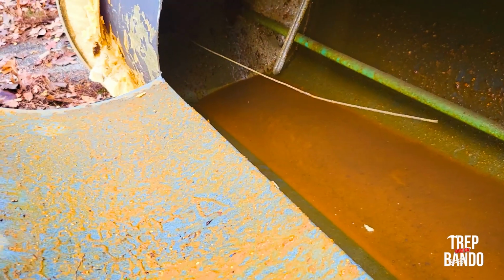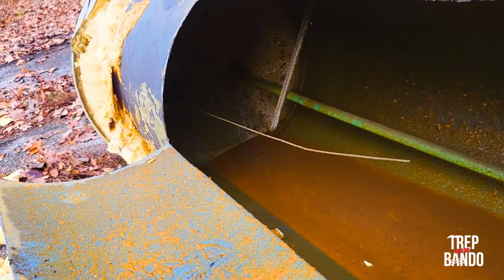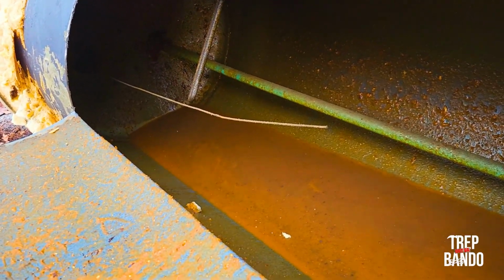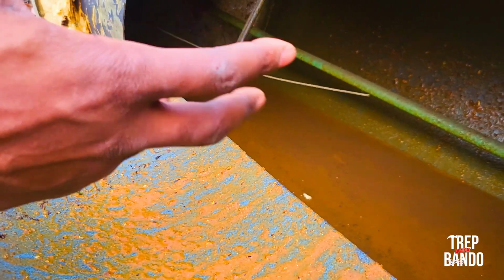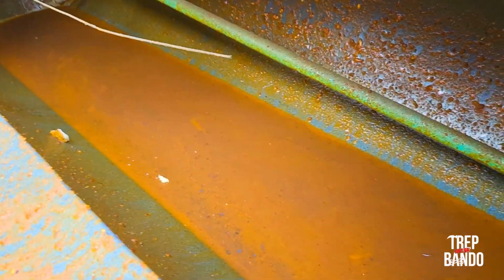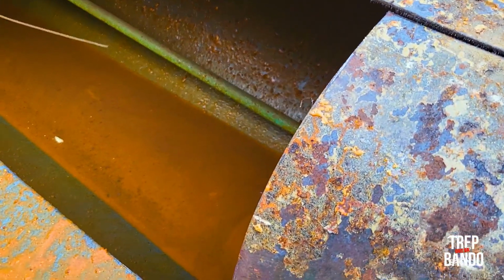Where does it even come from? Is that a heat sensor, a thermostat? Probably a thermometer of sorts. But it's pretty basic, right? Yeah, now that we look at it, we know the cold water comes in and fills up the tank. Once it's heated and you turn on the water, the pressure pushes it out of the hot. It's pretty much just an open container with a 2-inch layer of insulation and then an outer housing with a few access panels and relief valves.